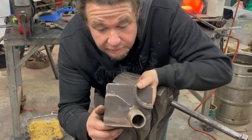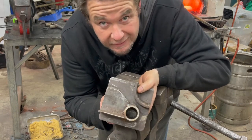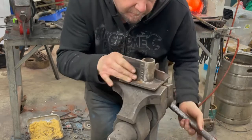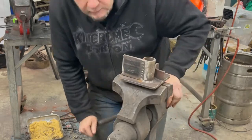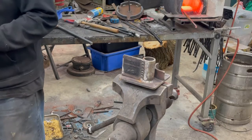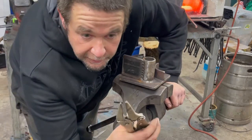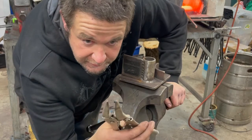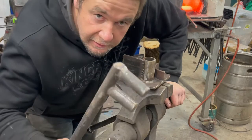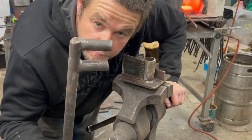This is a little jig that I made for doing my fireplace tool coal rakes — a couple of bits of plate, a bit of tube, welded on a little jig that goes in the vice. I've got a pair of pointy nose vice grip pliers here that we'll use with this jig, and just a little bending wrench made of a bit of bar welded together.